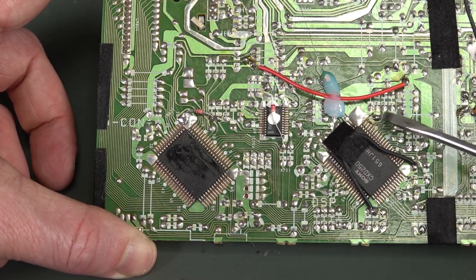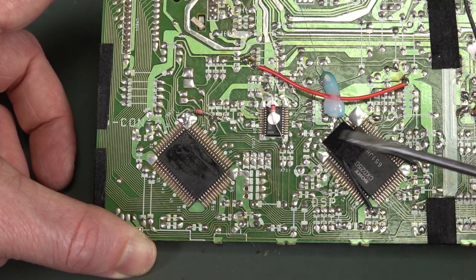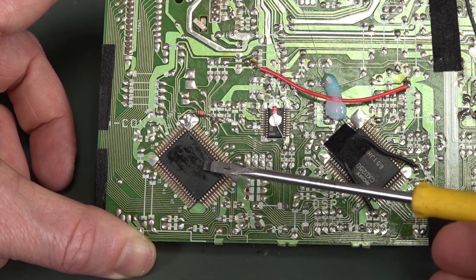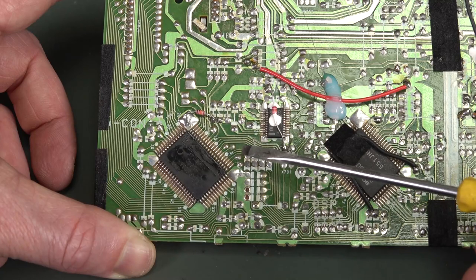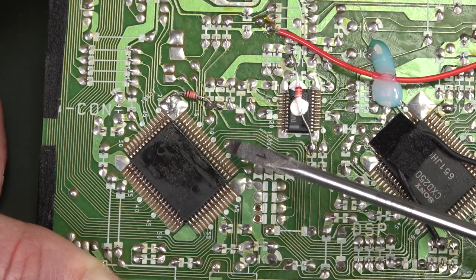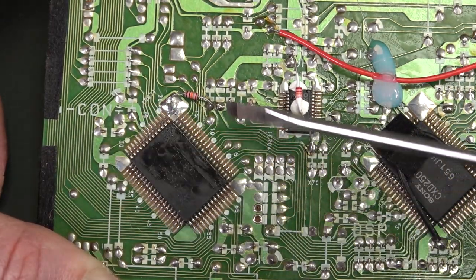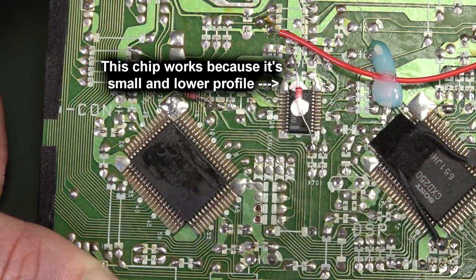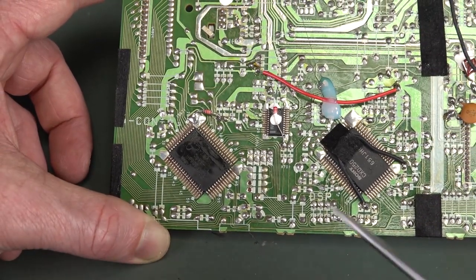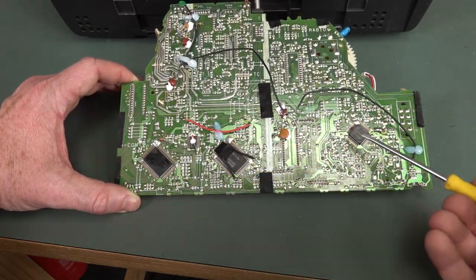There's the PCB — I really can't see any bulges in those caps. Doesn't look to be a problem on the surface. Putting them directly under the heatsink like that is a bit silly though. I love the jumper that goes right over there. See the star grounding in there, and the star power as well. You can see the solder feed-in on the chips — this is when they put it through the wave solder. They put these little solder traps to stop the pins getting shorted when it passes through the wave soldering machine. They deliberately mount these chips at 45 degree angles to prevent shorts between the pins, because there is no solder mask between pins. If you have the chip square, all the pins on one side are going to be in a solder wave shadow as it passes through the machine.